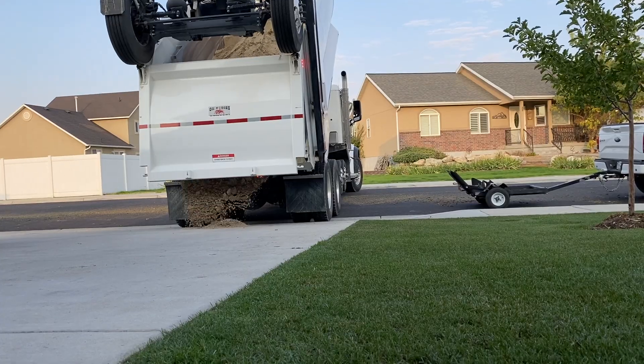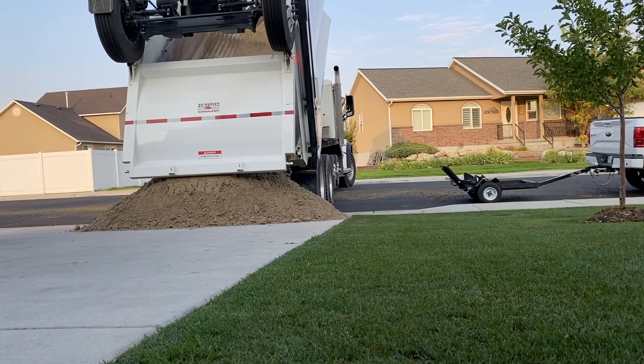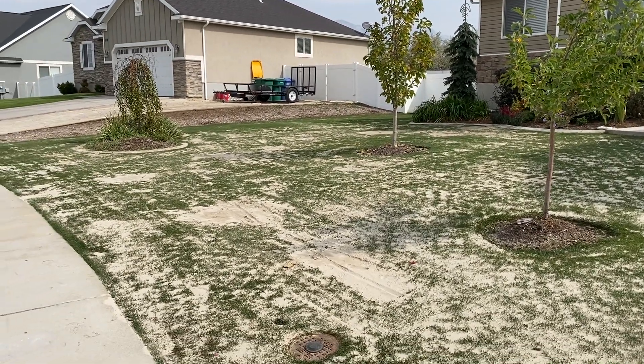As far as how much to get, most places that you order bulk sand from will take your order by the ton. When you're used to keeping track of volume in yards, converting to tons can be a little confusing. So 1.4 tons of sand is equivalent to one yard of sand — so if you order a yard you can expect 1.4 tons, almost one and a half tons. I say one ton per thousand square feet is a good starting point. It depends on what you're trying to accomplish, but start there if you're not sure.